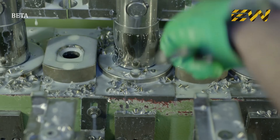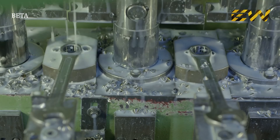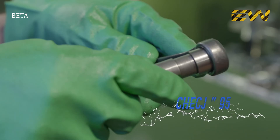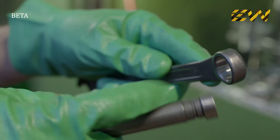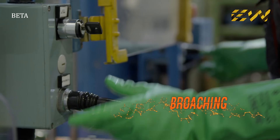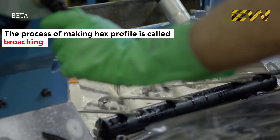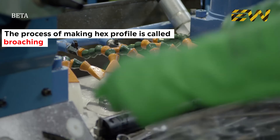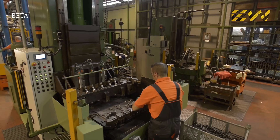A multi-spindle drill creates accurate bores on the ring end. The mechanical department controls ensure that the operating ends are in full compliance with the tolerances. For correct matching of the tool to the nut, a shaped tool called a broach is inserted into the bore and pulled down, generating the bihex profile of the tool. The process of the open end is similar, using an external broach.